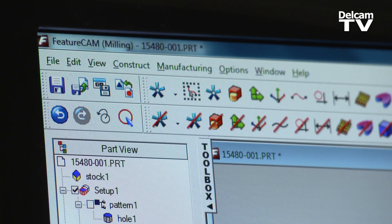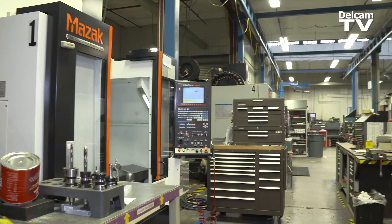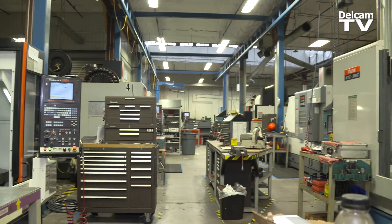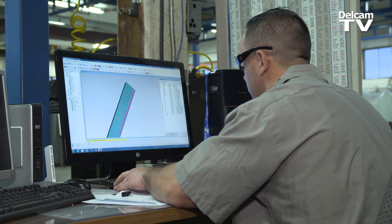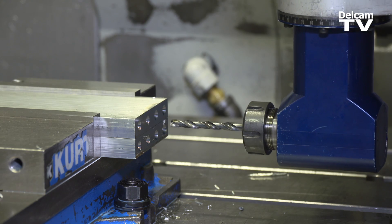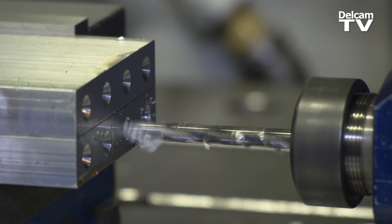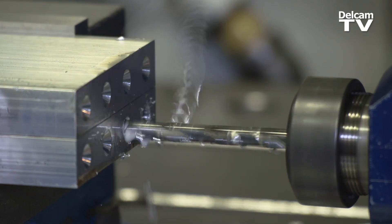A very powerful CAM software. We use it probably 70% of the time. We got FeatureCam along with our Delcam PowerMill, which we use on our tool and die side. It's all Mazak, so we use a lot of Mazatrol and they can step away, write their FeatureCam program, which allows them to do some surfacing and get the next part up and going. That allows the machinist to do the simpler parts and let the programmers take care of the more complex.